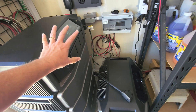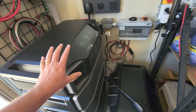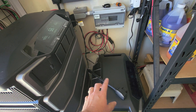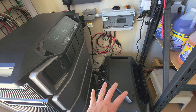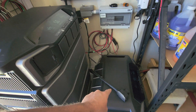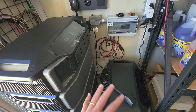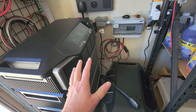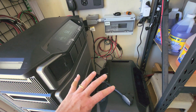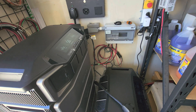I did notice when it was connected to the smart home panel, it did a state of charge balancing — it took a big chunk of power from one unit and put it over to the other, as long as that one was under 30%. If one was in the 60s or 70s and the other was under 30% — or vice versa — it would stabilize the charge between the two right through the smart home panel, sending 7000 watts to and from. It has not done it when either battery was over 30%, even with a 40–50% charge difference between the two.